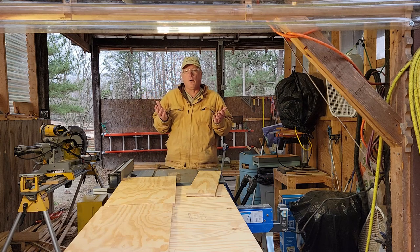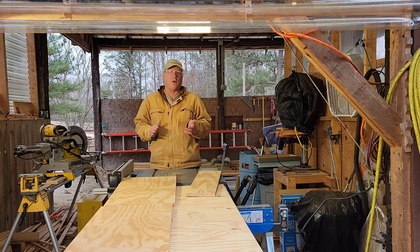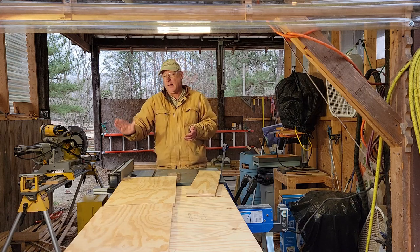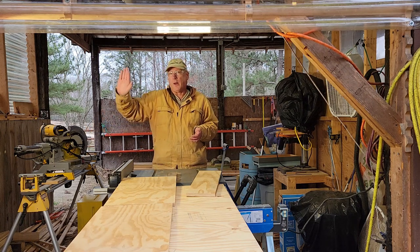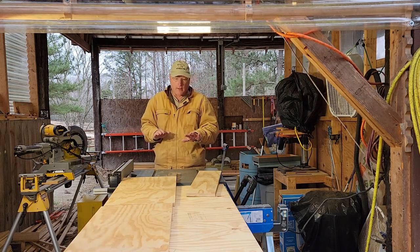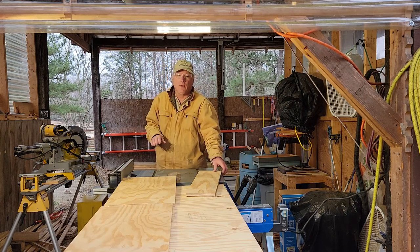Okay, so now you saw how quick and easy it is. So one point of emphasis as I was pushing it through, because this board was between the blade and the fence, that's where the potential for kickback is. So I was pushing down and in with my control hand as I was pushing it through, and I'm holding it down here, and I'm pushing it with my left hand, but mostly just keeping this piece controlled